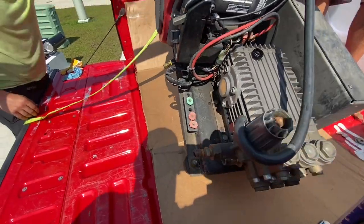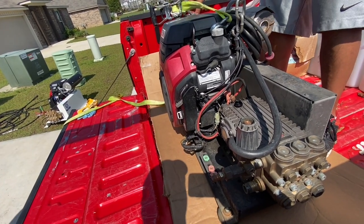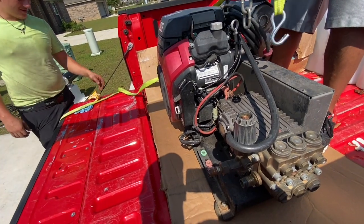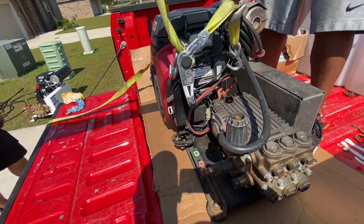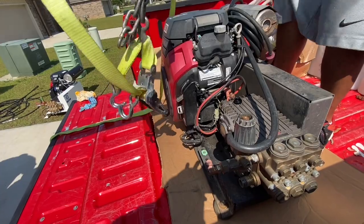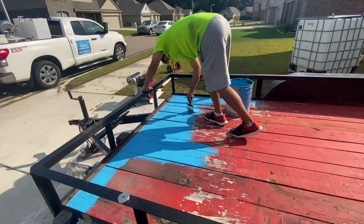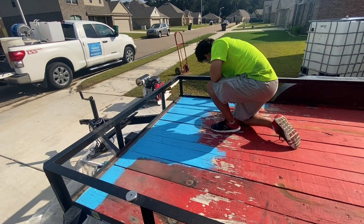And as you know, these machines have fuel lines that had to be disconnected, battery cables, and water plumbing. So make sure your battery cables are tucked up, because there are two battery cables that come off these machines. Whether you're mounting one or taking one off, exchanging it out, make sure those battery cables don't get tucked back under the machine when you set it down.